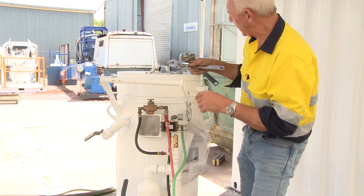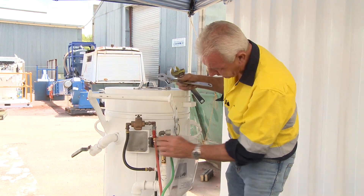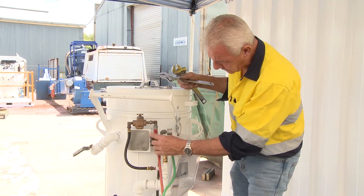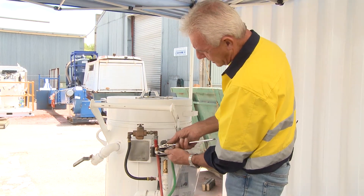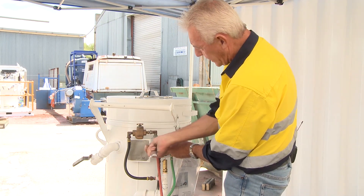What I will do is, when the pot tender activates the dead man, I'll just check them for leaks to ensure that I've got them. Nothing wrong with a little squirt bottle with detergent and water to ensure that I have a seal there and moisture doesn't escape unnecessarily and undermine the operation of the dead man.